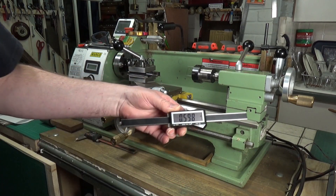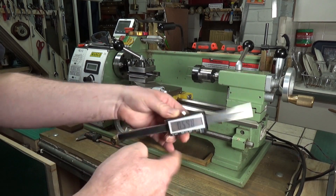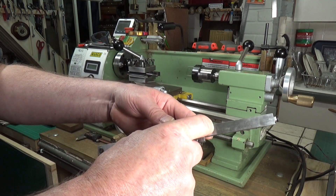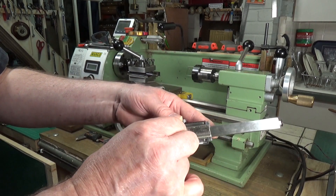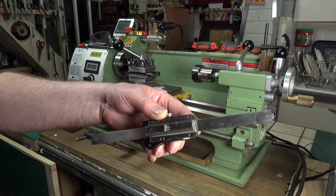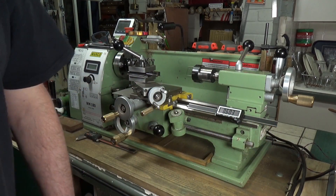What I came up with was equally simple. This is not a digital caliper — they call these digital parallel marking gauges, and there's a little blade on the end. What I've done is taken a small block of mild steel, milled a slot in it to take these very small flat rare earth magnets, and glued them in place using a thin film of chemical metal on the underside — though any modern metal epoxy would work absolutely fine. So that now has got a magnetic back to it, and you can clamp it onto the ways — these magnets are really powerful.